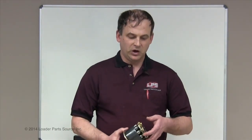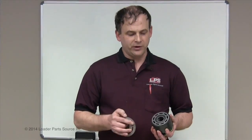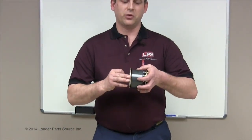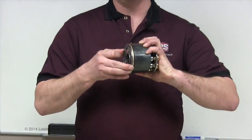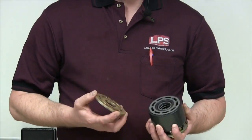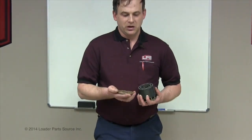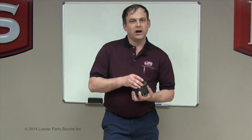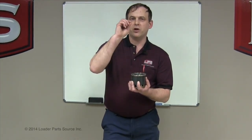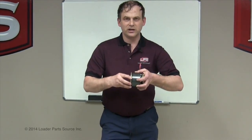On a drive system, this is out of a standard drive pump that's used in almost any brand of machine. These surfaces here spin against each other at 2,000 to 3,000 RPM under load. You can't seal it with a conventional seal. What the engineers discovered is they can get these tolerances so close that the oil film is thicker than the tolerances and the oil cannot escape through that. You see this thing spinning on here — this is the inside of your drive pump.